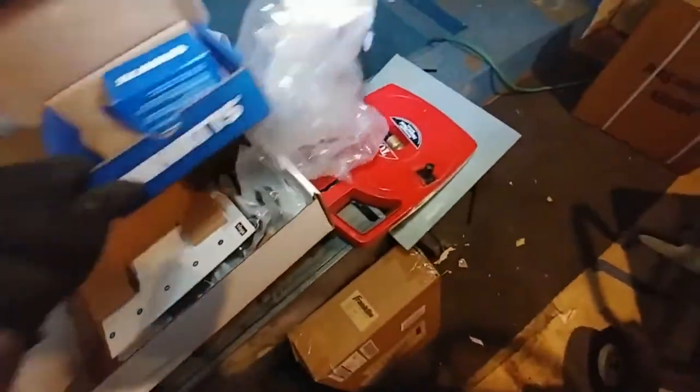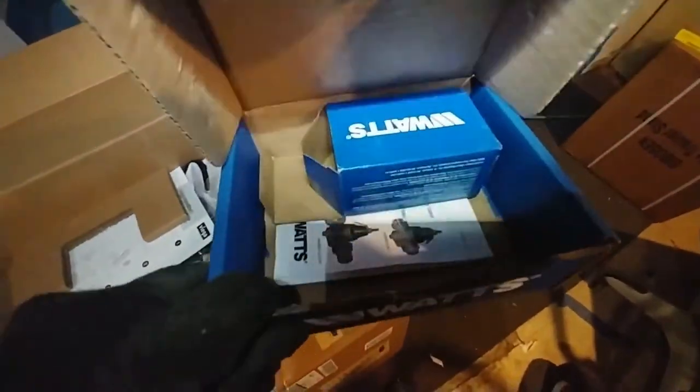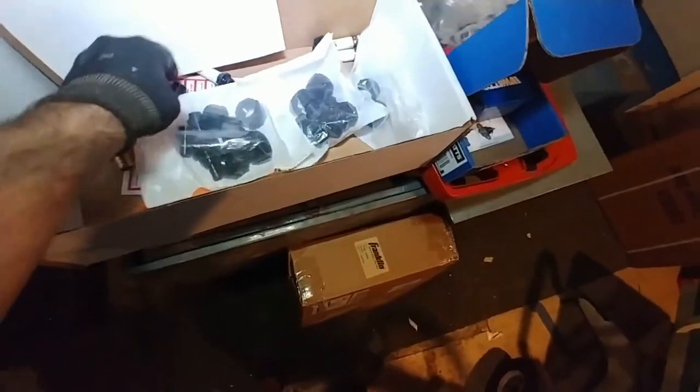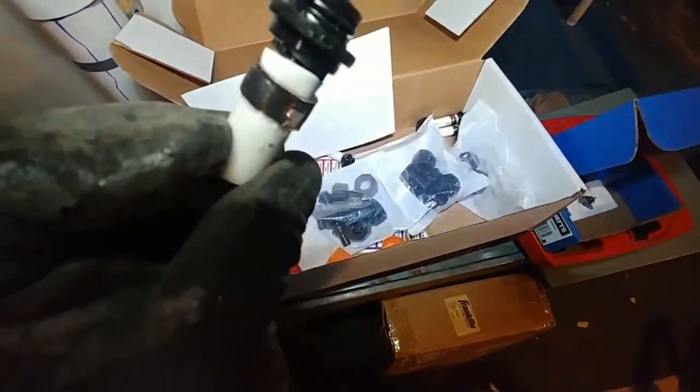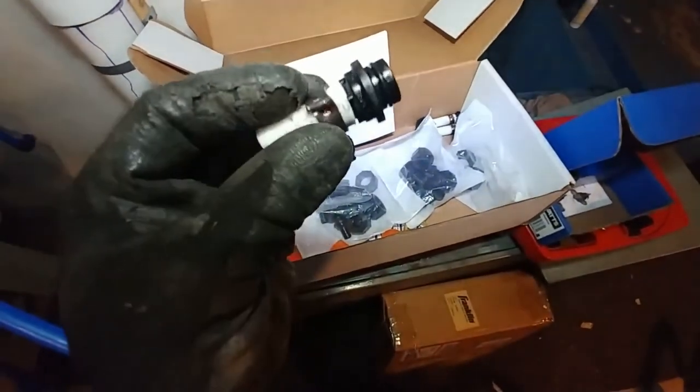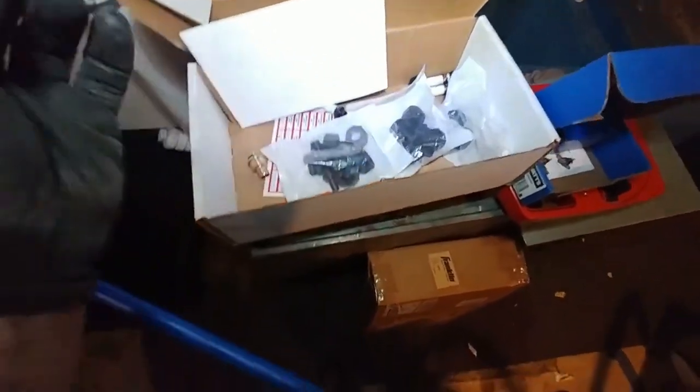He's half inch. Oh, and we can look at that water service. I did a new mini dual check and pressure regulator, all of which were 3/4-inch lines. But these here, we messed up because the crimper we were using isn't right, I don't normally use these bands. My buddy thought he had a swage tool for them, but he actually has a swage tool for stainless steel. So it messed these up.